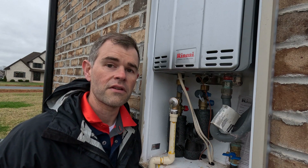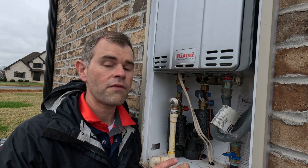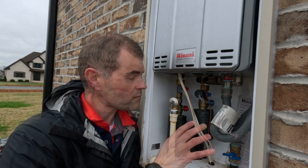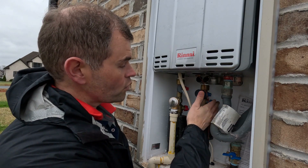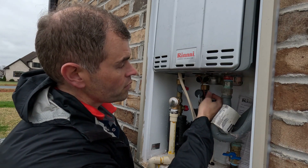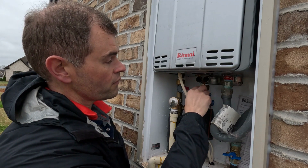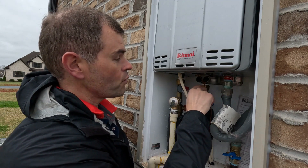So the process for this is you get a pump and then you get two hoses. The very first thing you want to do is turn the unit off and then turn off the gas valve here. Then you want to turn off your quarter-turn valves here — what this does is it stops water flow from getting into the unit. At that point we will open up these service valves, which allow you to put water into the unit from the service port here.